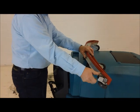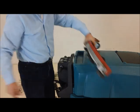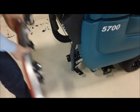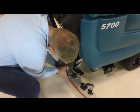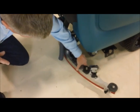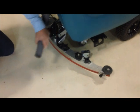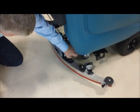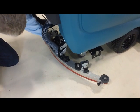Just tighten that back up. You'll notice the squeegee is held on with two slotted mounts on the back. The idea is that if you hit something, its first line of defense is it's going to swing out of the way. If you hit it hard enough, its second line of defense is it will simply break away and come out of its mounts rather than damage the machine. Same with our recovery hose — there's no clamp on it, it just slips over, so we don't need to worry about the hose ripping if the squeegee gets torn off.